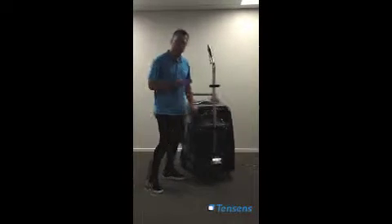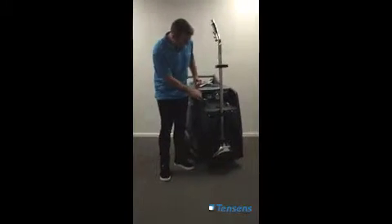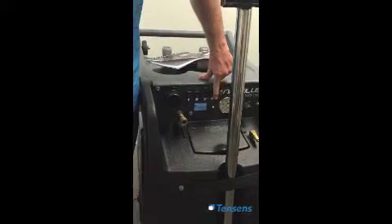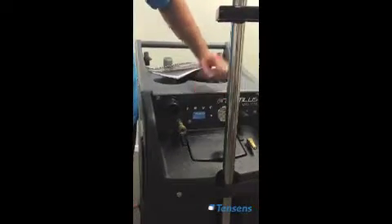Let's quickly run through what your machine is. On the front of the machine, you've got your vacuum, your pressure out which goes to your wand, your vacuum switches — individual switches for your vac motors — your pressure pump, and your pump out pump. Your pump out pump is for your waste, the dirty water that's going out.